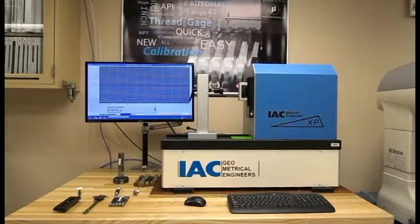So we're going to change now to doing an intermediate calibration. It may be confusing why we need a master and intermediate calibration. An intermediate calibration is actually used to determine if the probe is on center — using a known diameter of an intermediate piece, it tells how far off center it is and compensates. I'll take the click-on attachment we're using, just like the master, goes on really easy. Take our intermediate, put it on real quick.